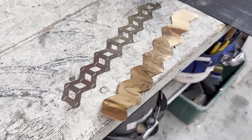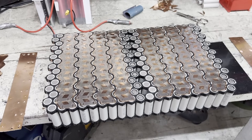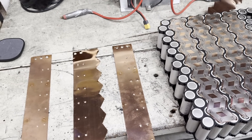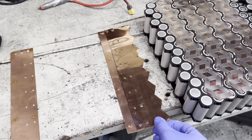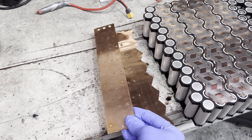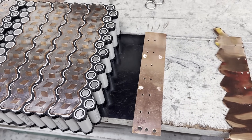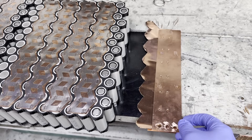Now that I have the layout figured out, it's time to start spot welding, with 0.15mm nickel and 0.15mm copper. I have all the spot welding done except for the center section and the two ends. Over here on the negative side, I've got the 0.5mm copper sheet, then the 0.15mm copper so I can spot weld, and then another 0.5mm copper sheet on top, with little screws to clamp it all together. On the positive side, I'm going to have the 0.5mm copper sheet, then the 0.15mm copper to spot weld, and then another 0.5mm copper sheet, just like the other side.